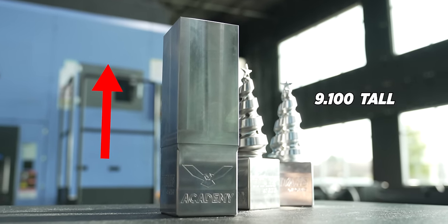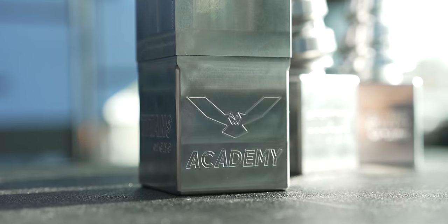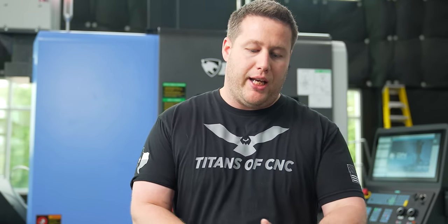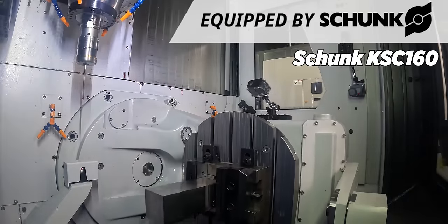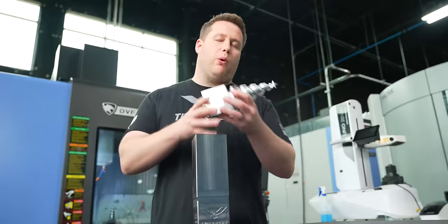This part is really tall, so the things we could get away with on aluminum we're not going to be able to get away with on titanium — some of our techniques are going to have to change. Starting off, we're going to have to go with a bigger vice. With the aluminum part we went with the KSC 125 vice mounted on a riser, but it's not going to be strong enough to hold this titanium and rough way out at the top. So we're switching to a KSC 160 to get a taller jaw and stronger clamping force.